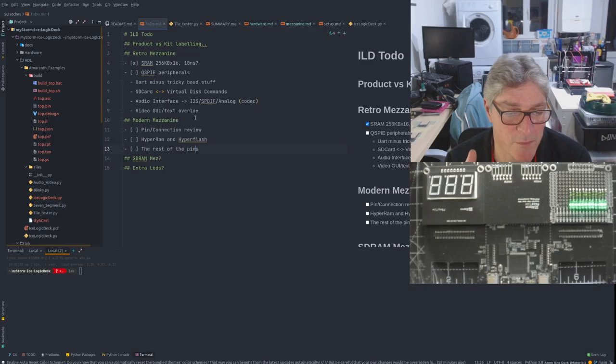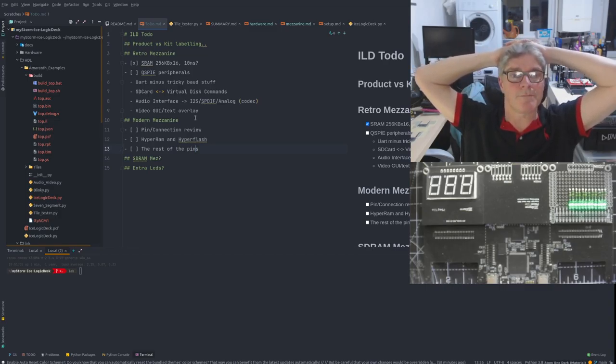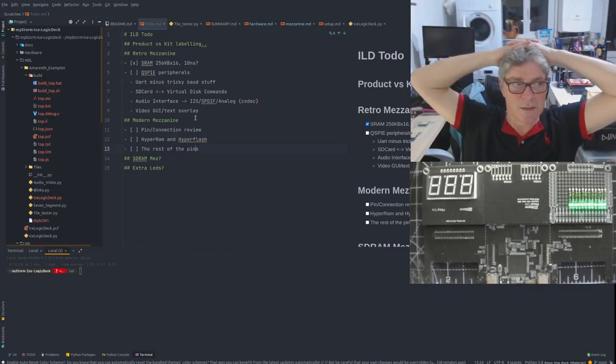But does that mean that you have to load the font as well? How much memory does that take? What's the overhead? Because it all eats into that. It either eats into that 16K internal, the fast memory, really fast memory, or we start taking a chunk of SRAM. But if you start taking a chunk of SRAM for this, then you kind of interfere with the graphics or frame buffer interface that's running on the retro game at the time, and you want to try and avoid doing that where possible.